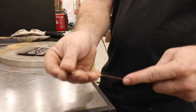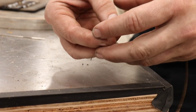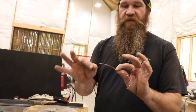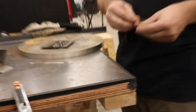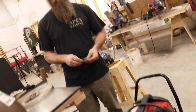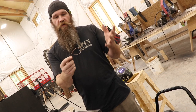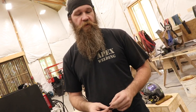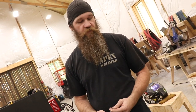With 110V machines doing short-circuit MIG, the wire contacts and electricity literally blows the wire apart, depositing the weld metal over and over. Thinner wire is better because it takes less power to blow it apart — 0.025 works a lot better than 0.035 on 110V. Don't use an extension cord if you can avoid it, but if you must, use the heaviest gauge possible. I use 10-gauge for 100-foot runs. For 50 feet, 12-gauge works fine, but at 150 feet you'll see a noticeable power drop.